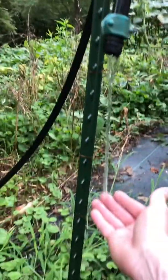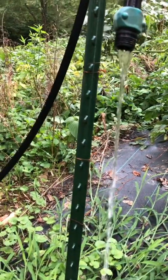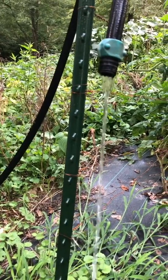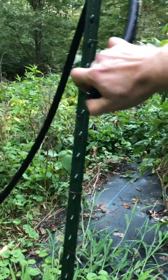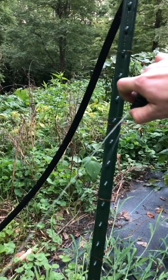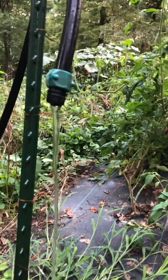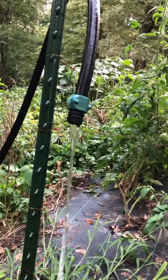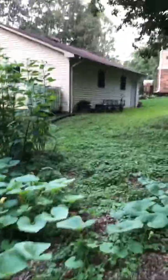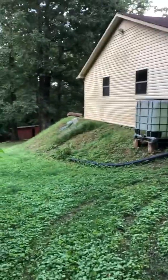This doesn't look like a huge amount of water, but with the pressure I'm able to put behind it coming up that hill I can irrigate my garden through a soaker hose. I can tap this off with my thumb and within a few minutes it'll build up pressure and I'll be able to shoot water a pretty considerable distance just by restricting it. At about a gallon every two minutes and 15 seconds, that calculates out to about 630 to 640 gallons per 24-hour day, and this system runs 24/7 unless something stops those valves from clacking or restricts the water going into the inlet pipe.